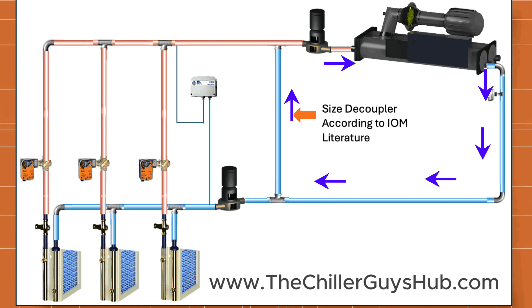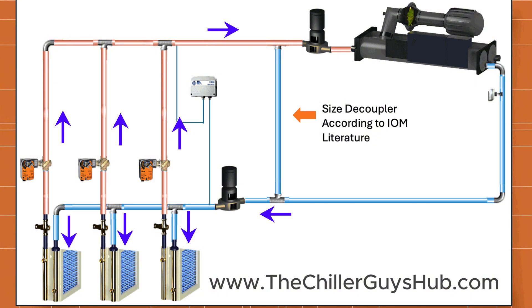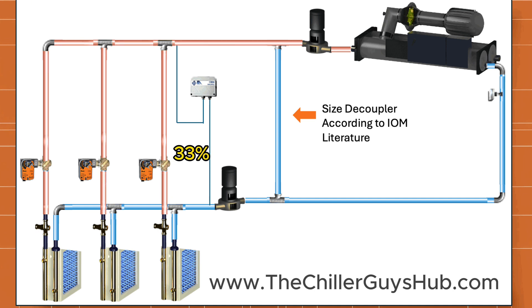The primary pump just keeps circulating back and forth until the secondary pump fires up and starts pumping chill water to the coils or to your load. What it does is lower the pressure on the inlet of the secondary pump, and instead of flowing through the decoupler, water starts flowing through the secondary pump out to your system. The only thing keeping it from constantly recirculating is physics.